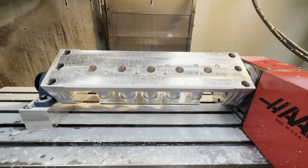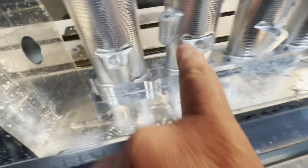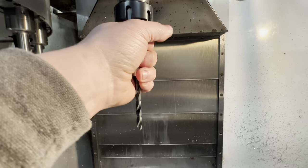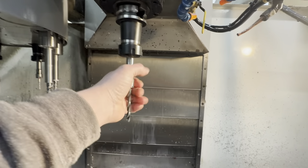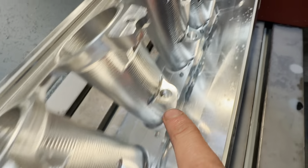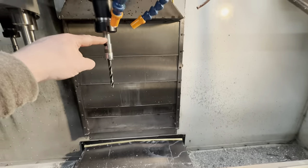So we're getting there — we've still got a bit more to do. I can't come in and drill these counterbores yet, annoyingly, because we've got to wait for our drills. I'm going to have a go with this 8mm drill — only 70mm flute in an ER16 collet into my ER32, so it's pretty rigid. These aren't the best so it might give a bit of run out but I'm going to try it. You can see where we flat-bottomed the pockets for the injector O-rings — we've now done a spot drill in each of them — and we're going to have a go at drilling these. We've got plenty of clearance on our length and we should be fine drilling right through.